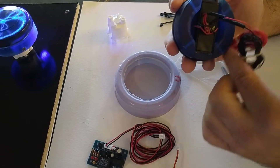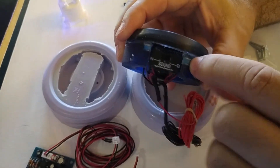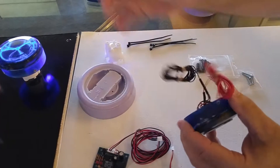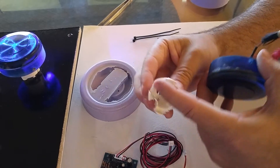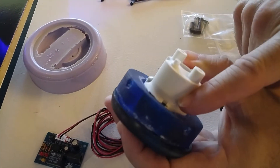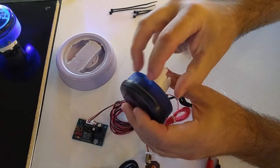This next part is what we call the collar — this is how you mount it into the game. We also hand-make the collar in a resin mold, and we put LEDs in it that will light up, giving a nice glow below the plasma. The body you receive with the plasma pop bumper is basically a standard pop bumper with areas cut out and with holes. It fits into a groove, and there are four holes along the perimeter. You want to put screws — which are supplied — into at least three of those four holes, which will lock the plasma in place.